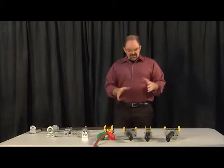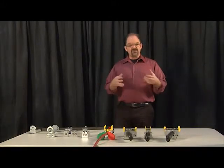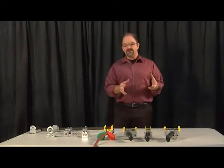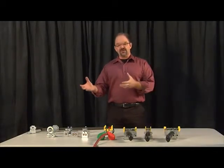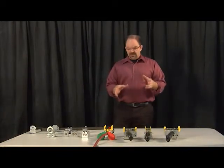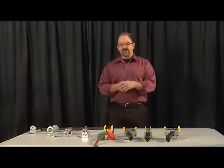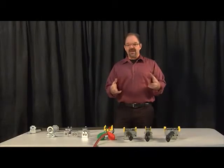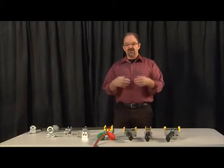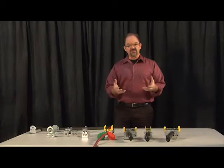So as far as applications, we talked about the air, we talked about the electric. Applications, this is part of the G-Force product line. If you have not watched the G-Force videos yet, I encourage you to go on Gorbel website or the Gorbel YouTube channel and watch some of the videos on the G-Force product. It's a great product. But these handles can be used in conjunction with the G-Force lifting device, mainly for end tooling. So they can actuate functions for end effector tooling, like clamp functions that get a hold of your product, vacuum on, vacuum off, clamp on, clamp off, things like that. That's a very typical use for them.